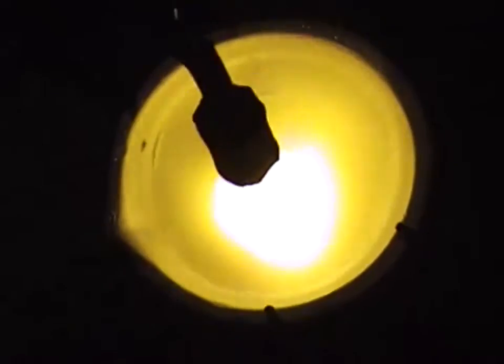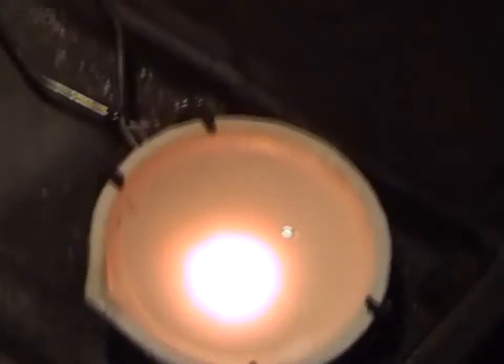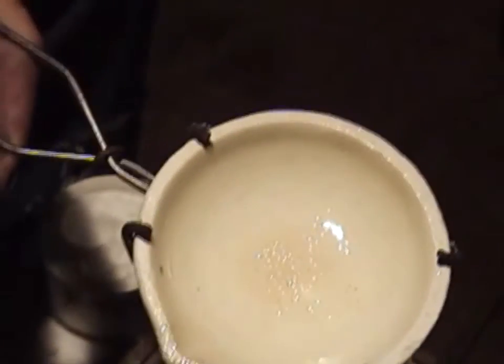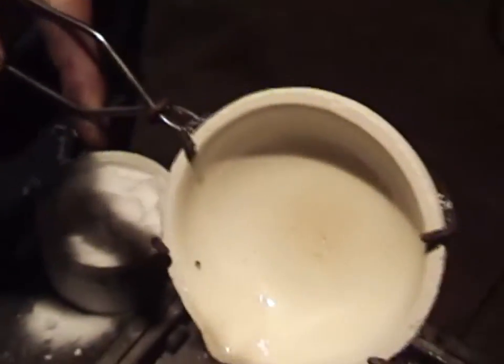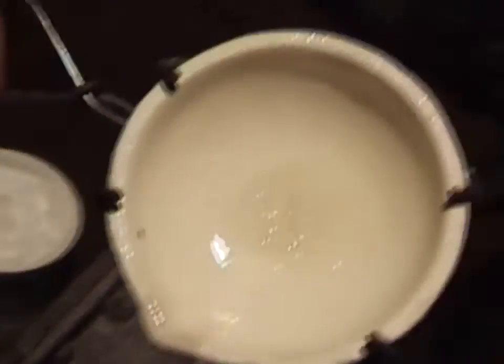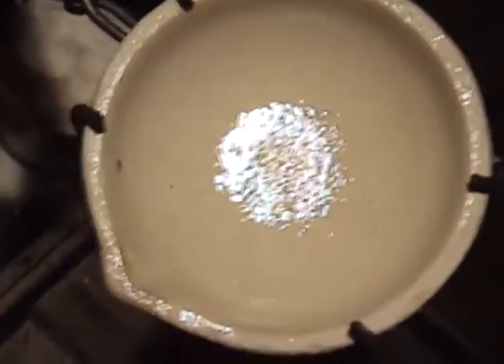Make sure we heat the bottom again good. Now when we add this silver to this dish, there is no need for any flux whatsoever. This is pure silver in a clean glazed dish — you don't need any flux, and if you do, you haven't done your job properly. Let's give that a second to cool. If you'll notice, it is shiny all the way around that dish, just like it's got a coat of fresh polyurethane including the lip area. The bowl is still white with no metals in it. When we finish melting pure silver, this dish should look just as good as it does now.